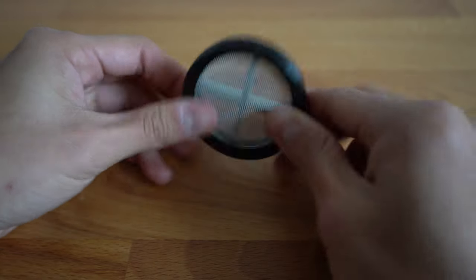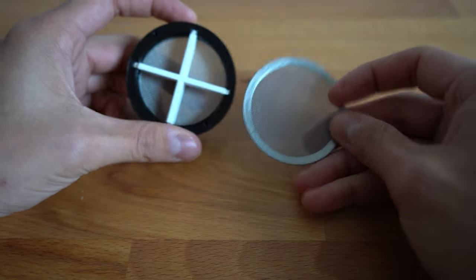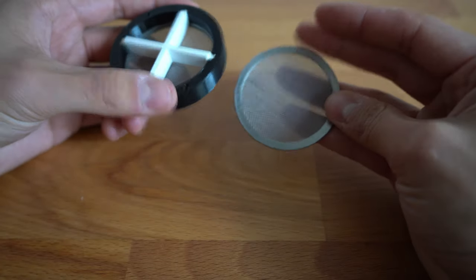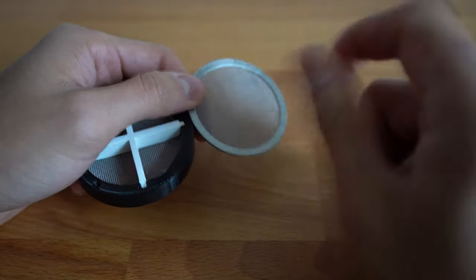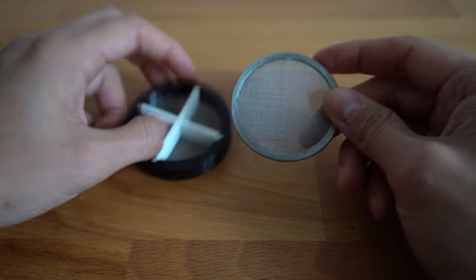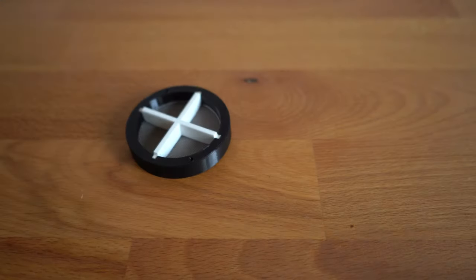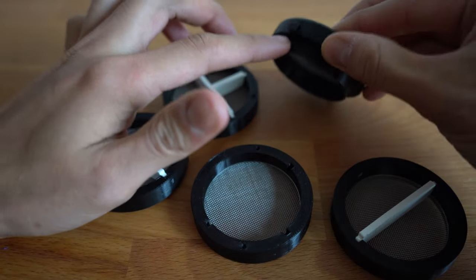The wall on the side is a bit thicker, and we have the mesh wafer on the bottom. This is an example of the wafer in its original state before being pressed in. As you saw in the printing process, we placed it in there, sanded it, and sprayed adhesive on it so the filament has a chance of gripping the metal. The flat mesh I originally tried didn't work — it bends, and the printer's extruder can get caught on it, which jumbles up the whole print.